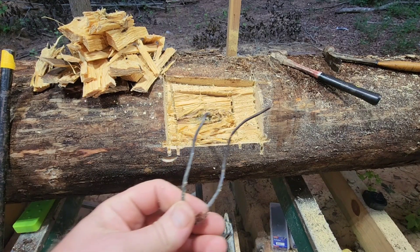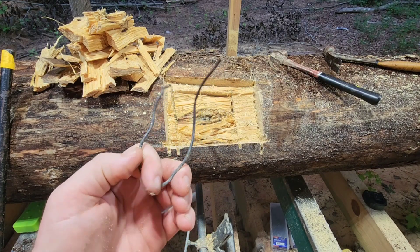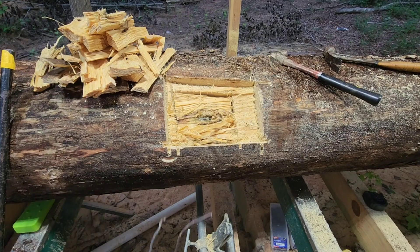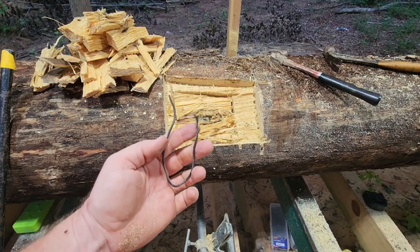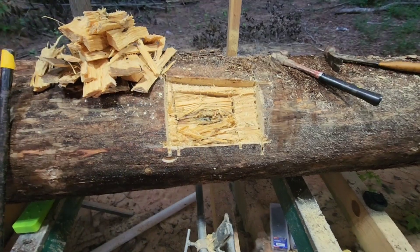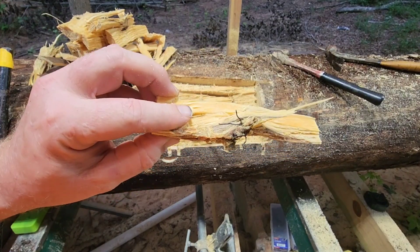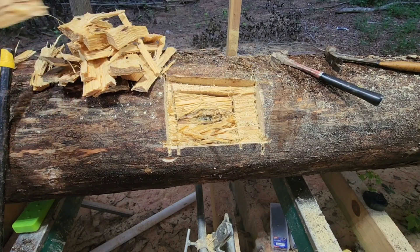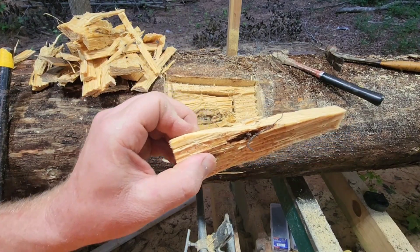Right here's another piece of wire that was sticking out through the bark — looks like somebody used a nail to bend over it. There could be wire all up through here. I could take my metal detector and check it, but I don't know how deep that's going. I'm still digging. Here's another piece that had some wire sticking out of it that I dug out. You can't just throw logs up on your mill and just go to milling.